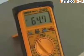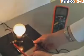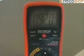Now we will connect both meters to a circuit connected to a lamp dimmer. A meter without true RMS will be off by a wide margin, as it is only capable of an accurate reading when connected to a pure, non-distorted waveform. Note the wide difference in the readings.